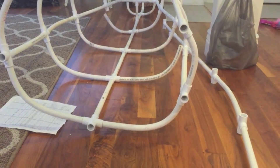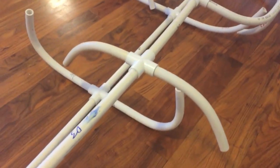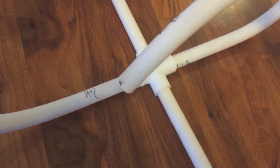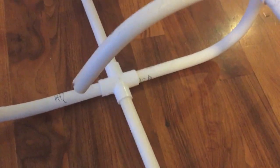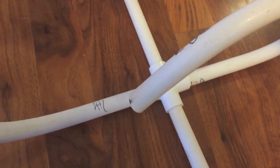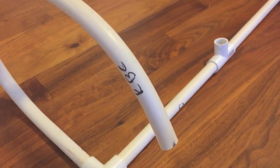distributed along the bottom. Second thing is on number two, the second rib, you'll notice here RT2, which is supposed to be on the top, is actually on the bottom. Those are mislabeled. I apologize. You'll have to go back and make sure the RT2 is on the bottom and RB2 is on the top.